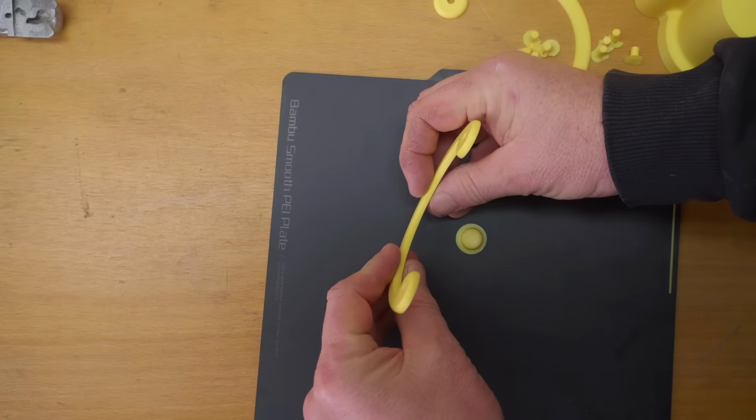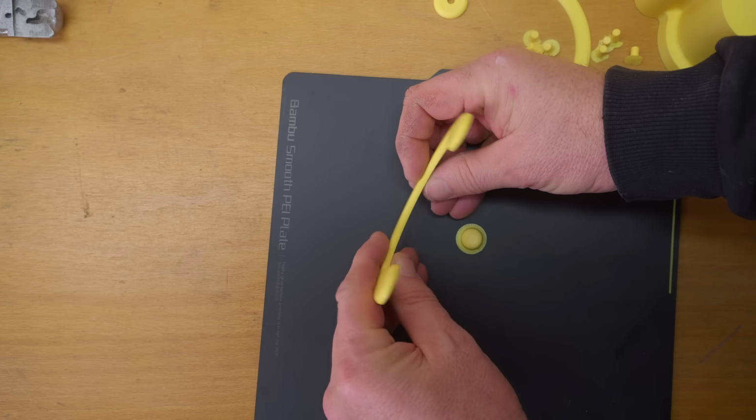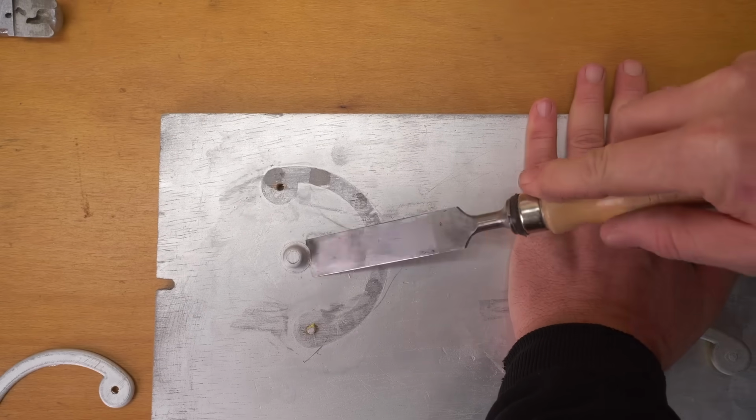And I increased the thickness of the runner from 3 millimeters to 4 millimeters because it was filling extremely slowly. Because I put the gating and runners on a match plate, each time I iterated the design, I had to modify it.